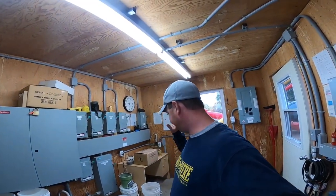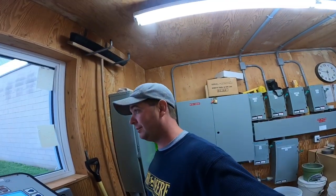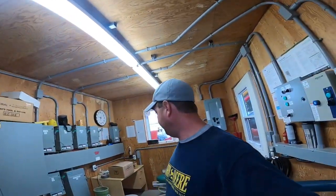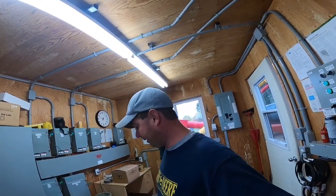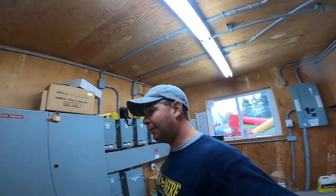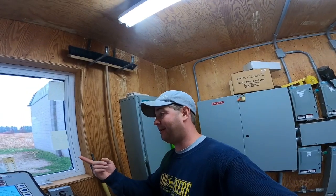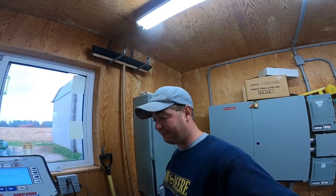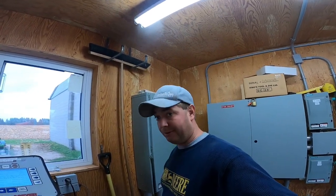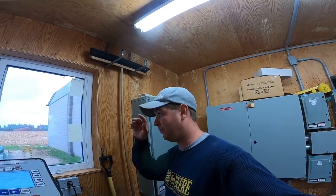Alright, so my tester's out a point. That sucks. So I'm gonna start the dryer and dry what's in the wet bin out of the wet bin, and then probably do the Canadian make-work project and do what I already did. I'm gonna start taking corn out of the bin that I dried into and find out where it's actually at, at least in the 15 mark, and re-dry the top. I think that's gonna be the game plan, but first I gotta get the wet bin empty.